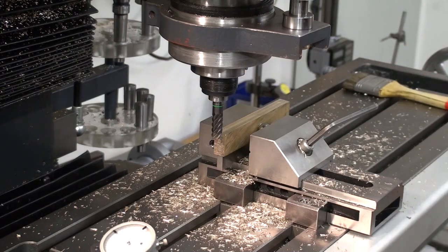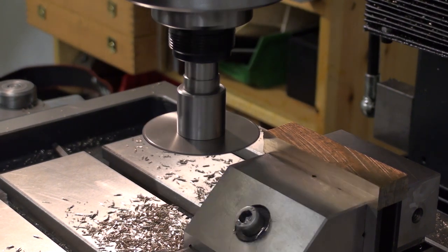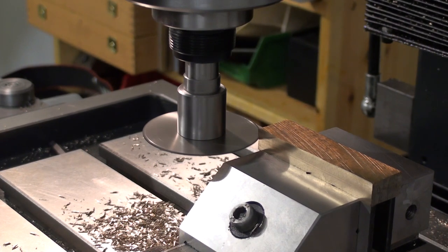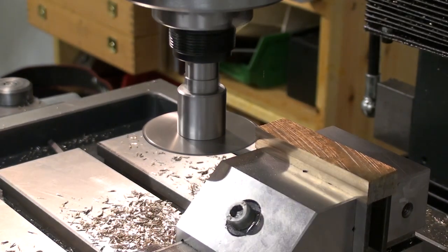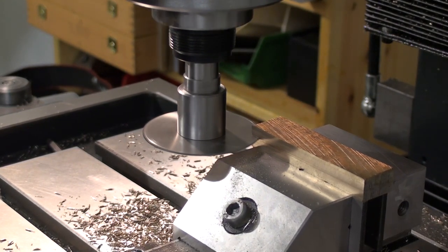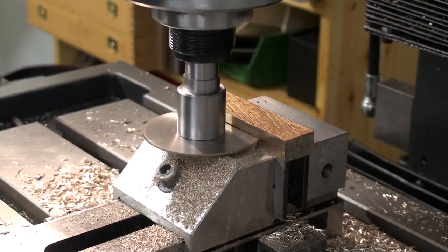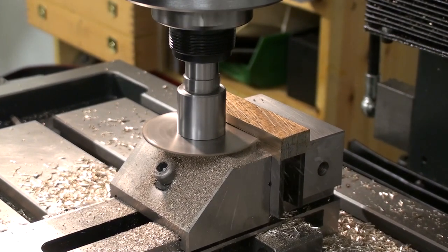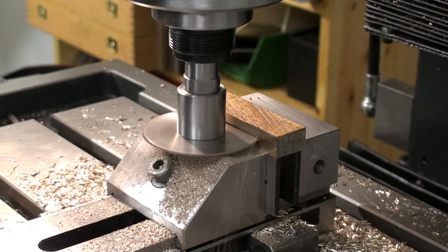As the material was pretty thick and I didn't want to machine away all the brass, which is quite expensive material, I decided to use a slitting saw and slice the piece up in thickness. So here I'm running the 63mm slitting saw, 1mm thick, through the material, but the cutting depth was not quite enough, so I have to go on both sides to cut it apart completely.